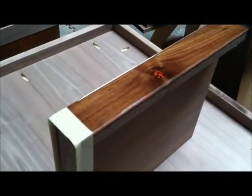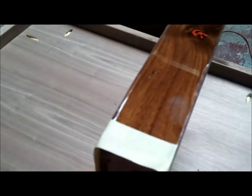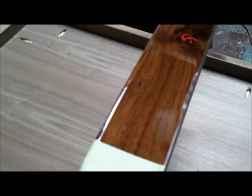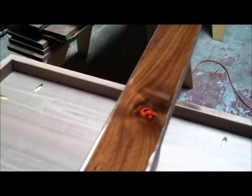Here's the sample from last night. It turned out pretty good — it's nice and flat, no bumps, ripples, or orange peel in the finish. It's clear and mirror-like. There's a little bit of a ridge around the edges where the epoxy sticks to the tape dam, which could be problematic when having to trim or sand in production.